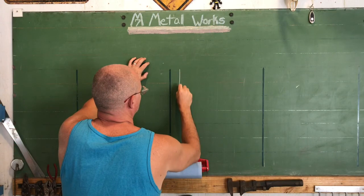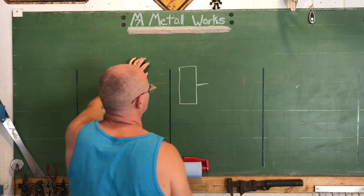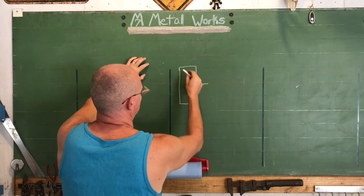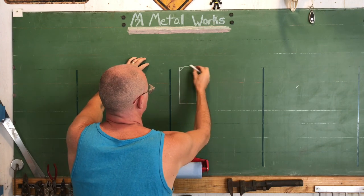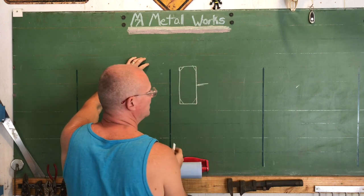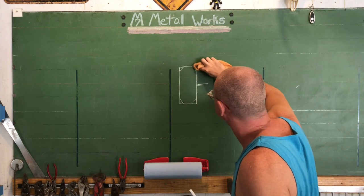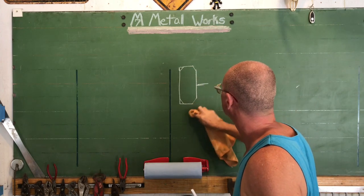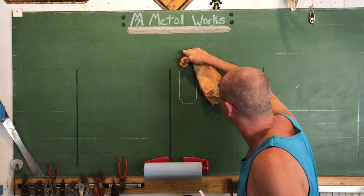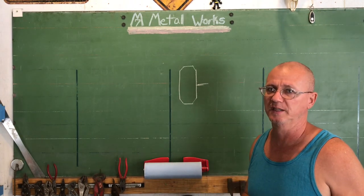If you think about the tires, the profile of them is pretty square. So here's your axle on that tire in the center, obviously. So what my plan to do on the bandsaw is to just kind of chamfer these edges and essentially eliminate these hard corners, so that when I change directions with this mower, it wants to center itself just a little bit better. So I hope that makes sense. Yeah, I think it's a pretty simple thing.